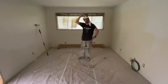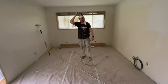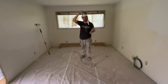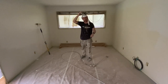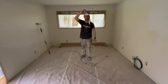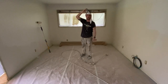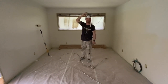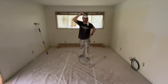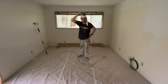I'm going to show you a quick area on how to spray these ceilings and walls and back roll it on. We're back-rolling just in case if the homeowners or us have any touch-ups at the end of the job — we're able to touch it up with a roller and a brush and it would blend and match in. Even though it's the same color, if we were to just spray it on and try to touch it up later with a roller it's not going to blend because the application process was different. So we follow through everything with the back roll to make sure that when we do have touch-ups, or the homeowner has touch-ups, they're able to do it and it's going to blend in well with the wall.